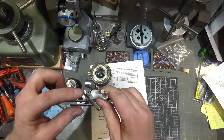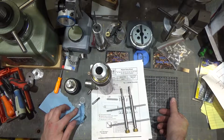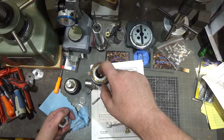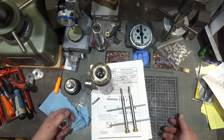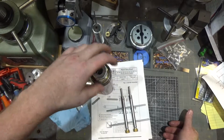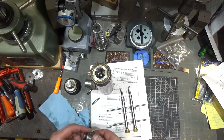you can see the ones I made last time. These are narrow, thin ones for camera parts, a specific camera lens I was working on. And I made this piece, which at first blush you may think you don't need, but you still might need it because I think you have to remove that lock nut and then lower the threaded rod into the top of the shaft so that the back of the spring will be clear. I didn't verify that, but there wasn't a lot of extra space with the spring when I just had the thread started in the top part here. So you may still have to get this off, in which case you're going to need something like this to stop this from rotating. You wouldn't be able to pump this up a little bit and then grab it with something, because you'd damage it, and then it would damage the top wiper, so that wouldn't be a good idea.